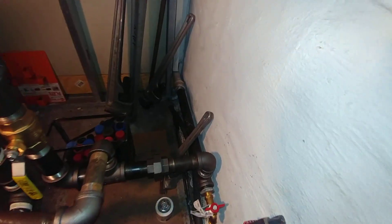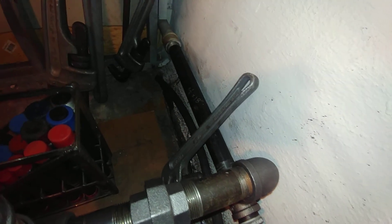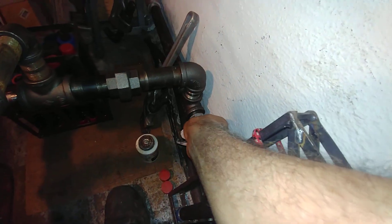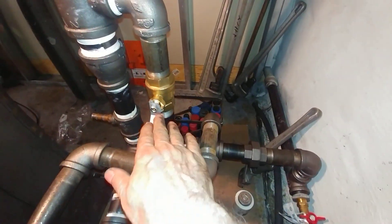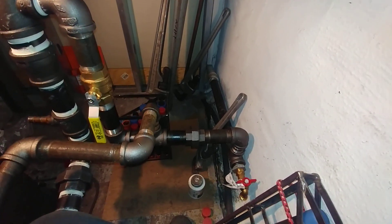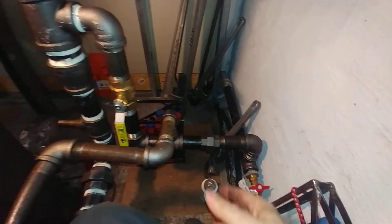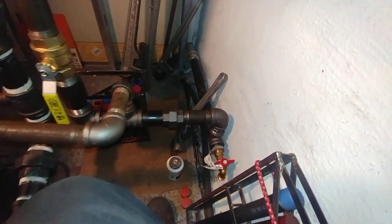None of this is put in permanently — this is more of a concept. We've got a place for drainage here, a quarter-turn drain, and a ball valve which will allow the water to be dumped while the boiler is still running. This is called a no-return flush — all the crud that's in this wet return can be dumped as the boiler runs. Essentially, it's a steam cleaning of the wet return.